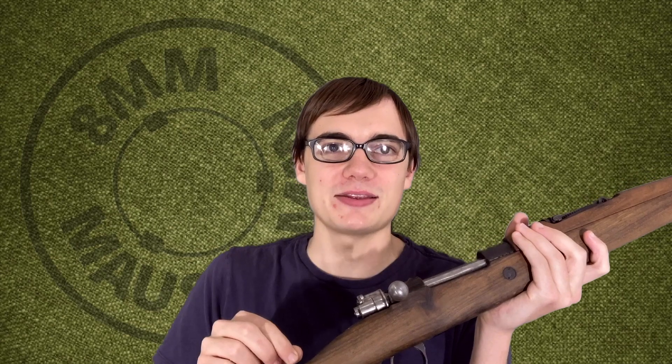Finally, to when I was bubba. This is a Yugoslavian Mauser, and if you know anything about the Yugoslavian Mausers, the action is just a little bit shorter than other Mauser rifles. So that means the firing pin and the firing pin spring are both supposed to be shorter. Someone, before the guy that I bought this rifle from, had put a K98 firing pin and firing pin spring into this rifle. So when you opened the bolt, it would work properly, and then when you fired it, you actually had to pull the cocking piece back manually, and then it would fire one more shot. Not knowing this, I had broken the firing pin upon disassembly, so I did end up buying a new firing pin.